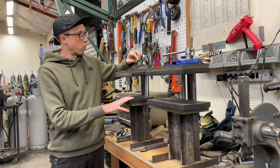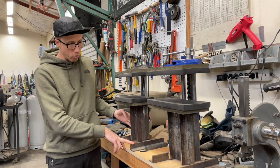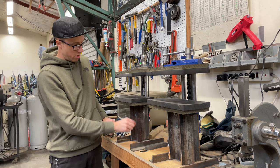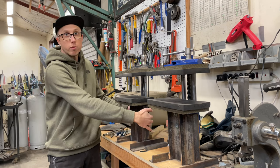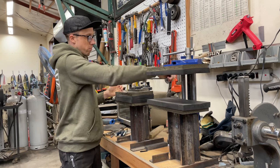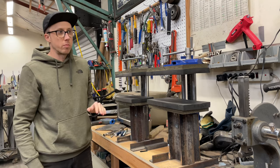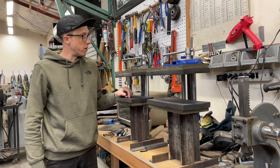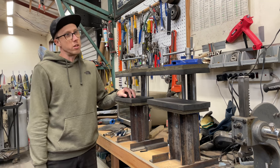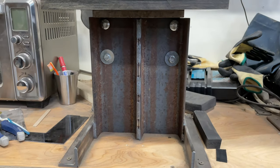These are simple woodworking quick release vises. I built these frames out of steel — you could build them out of wood, but I like how much more rigid the steel is. It's just a couple of legs mounted to a bench, a vertical piece, and then the vise bolts to it from the back. It's got a quick action so you can slide it up and down, tighten it down, and when you're done simply lift it up and go. I got two of them to make the process more streamlined, but even just having one makes a big difference in how quickly, efficiently, and consistently you can do a Kydex sheath.